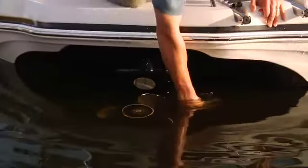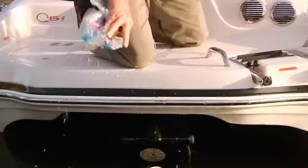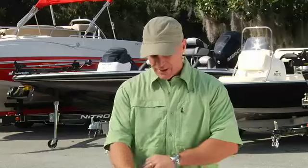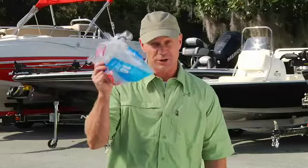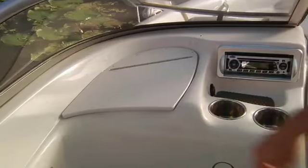This can occur any time you are out on the water. If you get a warning buzzer, high heat indication, or low water pressure at any time, stop the motor, trim up, and check the intakes. Carelessly discarded plastic bags can be a real menace — besides being an environmental hazard, they can wrap around a lower unit and cut off water flow instantly. So keep a good eye out for these, and be sure you are not one of the careless ones. Stow all plastic items where they cannot blow out.